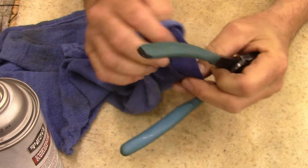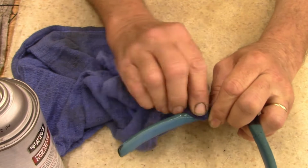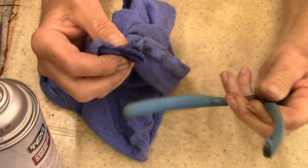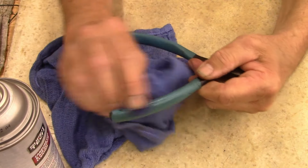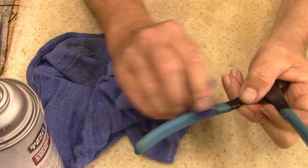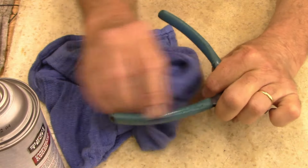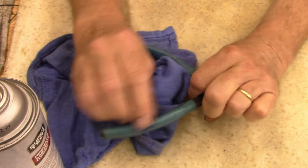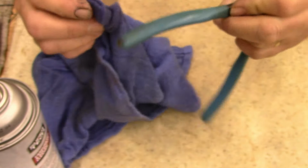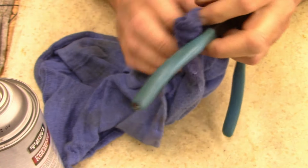And if you've ever dealt with commercial grade vinyl wallpaper, it's not true paper, it's vinyl. It's like a cloth. Sometimes when you get graffiti on there, you can't get it off, especially with a magic marker, and the only thing that takes it off is carburetor cleaner. And yes, you will take the dye out of the paper, and it's not paper, it's vinyl.